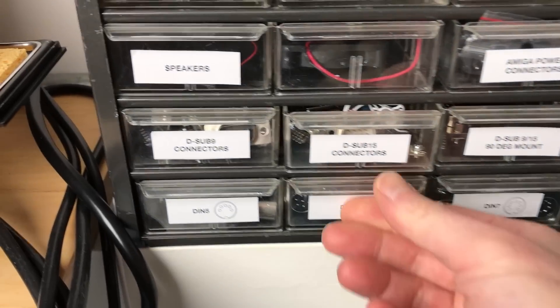Okay, with all of that out of the way, it's time to build the cable — but first, some preparation. This is a bit like cooking a fancy meal: the more preparation we do ahead of time, the easier the cooking will be. A lot of times 80s computers used DIN connectors because they were handy for carrying 5 to 8 different signals. I recommend you don't try to build the cable entirely from scratch. Instead, just buy the closest cable you can to the one you need and change one of the ends to fit the computer. That's also a lot easier than cutting two different cables in the middle and patching them — that always creates a weak point.